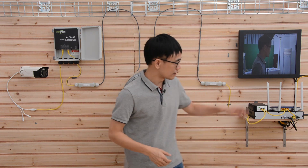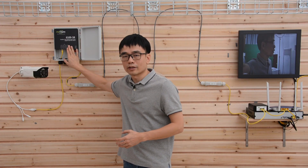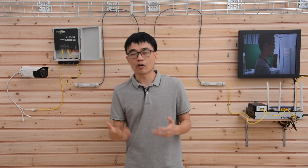You may be wondering about the power source — is it enough? It depends. This is a 90-watt PoE injector. With this setup, we could have about 45 watts available from this outdoor PoE switch. If you connect multiple high-power devices like a pan-tilt-zoom camera to this switch, it may not work. However, power should generally not be a problem because we do have a power source option at the new location.